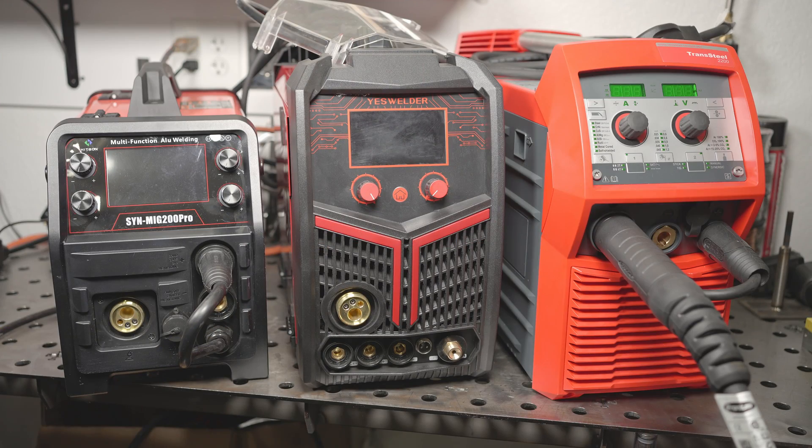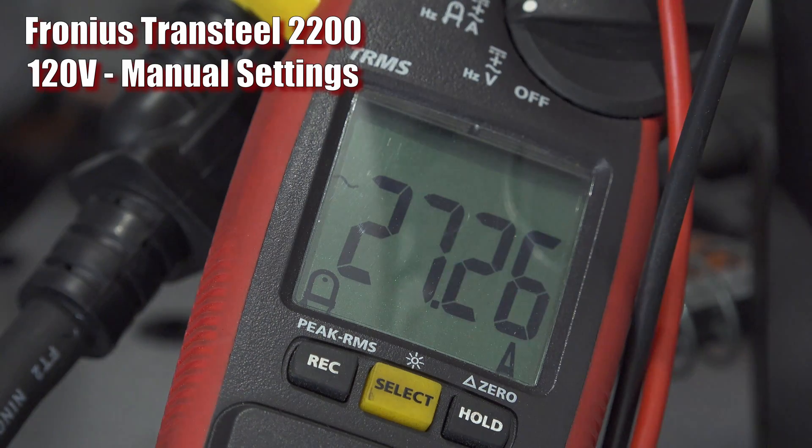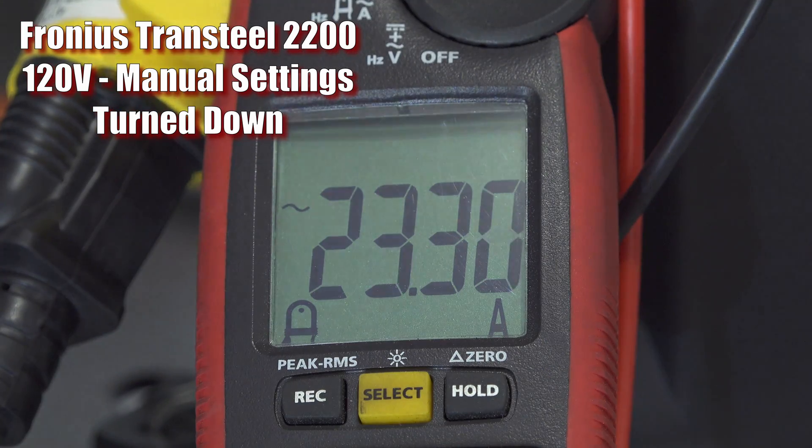But because the voltage is pretty low, it's still only a little over 3,000 watts of total output. If I leave the wire feed speed set where it was and turn the voltage up, the amperage actually comes down, preventing the output from going much over 3,000 watts. The upshot of this limit is that the max amp draw on 120 volts from this Fronius is around 28 to 30 amps — that's usable with typical duty cycles on a 20 amp breaker. And if I turn the output down to levels similar to what I get out of the YesWelder, the amp draw drops to around 22 amps.